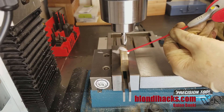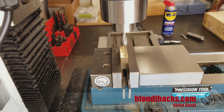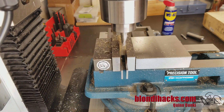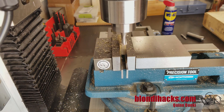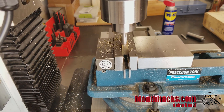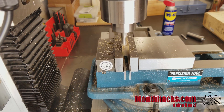We're going to start with some brass stock that's been cut on the bandsaw, a little oversized, and we're going to mill all the edges with an end mill. I'm using a two-flute half-inch end mill here. Soft materials like brass and aluminum do well with a two-flute mill because they need a little extra room to clear those chips. My end mill is a little too narrow for this piece, so I'm going to wind in the Y-axis and do another pass back the other way. I'm using the power feed here just to get a nice consistent surface finish.